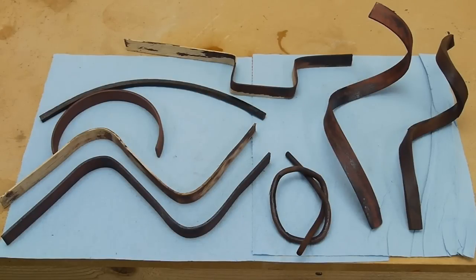A clever person came up with a product idea using this process: soak a piece of wood in ammonia, seal it in a bag, and sell it — the end user can bend it into whatever shape they want, then just pierce the bag, let the ammonia dissipate, and they have wood in whatever shape they need. I'll put a link to the patent in the description — interestingly, that patent just expired in the last year or two. You can now buy a product on Inventables that I think uses this process, marketed as bendable wood — you bend it into shape and it hardens, so it might actually be this very process.